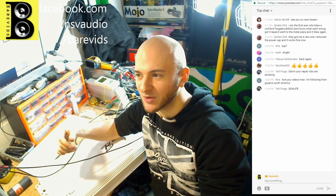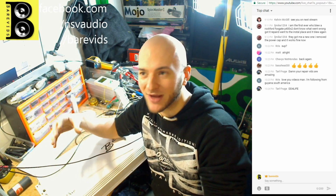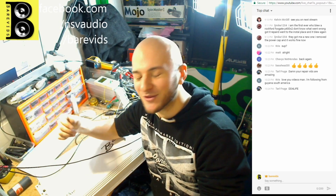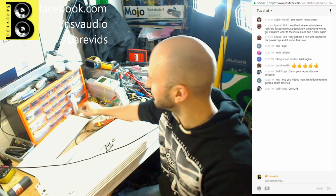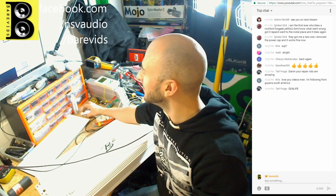And I was like, actually, that's not a bad idea. I haven't actually tried a 12 volt supply. Let's try a 12 volt supply just to see if this is one of those 1% of amplifiers that doesn't like 9.8 volts. And lo and behold, the bloody thing comes on with 12 volts. So 2 hours of repair time wasted, but no worries. We all make these silly mistakes sometimes.